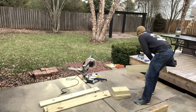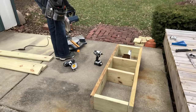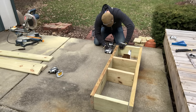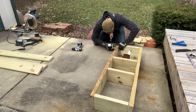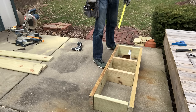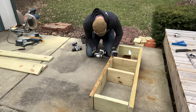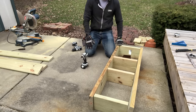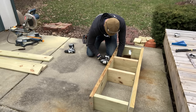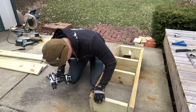Now I have all the boards cut and I'll set them up. Using three and a half inch deck screws — you can use a Phillips head or a square bit. On the ends I'm going to pre-drill the holes so when I'm sinking in the three and a half inch deck screws I don't split the wood, which is much more prone to splitting there at the ends. Getting the end secured and marking off the points — 16 inches and 32 inches will be the center of those inner two by eights to keep them evenly spaced. So basically one every 16 inches with a total length of 48 inches. For the middle sections I won't pre-drill, just putting in the three and a half inch screws.